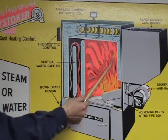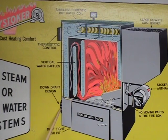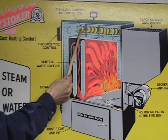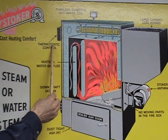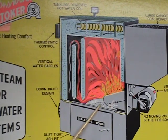Heat is generated up into the combustion chamber. This area here is the water jacket — gases go up and around the water jacket and out the exhaust. It also offers the option of a domestic coil for heating your domestic hot water, which is a lot more economical than electric or gas. There's a thermostatic controlled bonnet for the hot water system and an ash door where you pull your ashes out once a day. The efficiency of this unit is over 80%, very similar to a modern oil furnace, and a lot more economical to run.